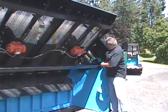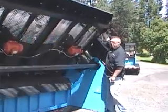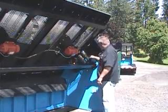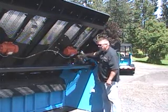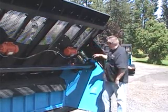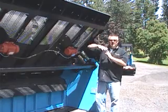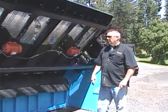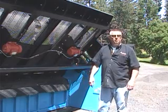This is our design with the C springs and the coil springs — the SLG 78 and the 108 use the same concept, but on the 108 we've duplexed everything on each side: two C springs on each side and two coil springs. There are only four grease zerks on this whole machine. You've got a pivoting point on each side that just allows the coil springs to center up as the deck's compressing. The C springs have no place to service. When you're done with this machine, you just blow it off, sweep it off, kick the dirt off, and throw it on the trailer. Really simple.